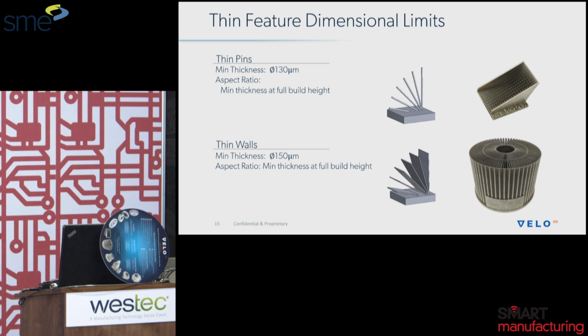Yeah, the aspect ratio. Because we have a non-contact recoater, we don't have issues with aspect ratios. We've basically been able to build extraordinarily high. There starts to become an impact if you grow very large sheets that don't have any cross-beam support. So for this example, for the radial heat exchanger, there's actually a mid-span spar, because otherwise you'll start to have a thermal buckling effect of the sheets. So it's important. Certainly there's the Z height, which I believe is more on par with what you were asking.